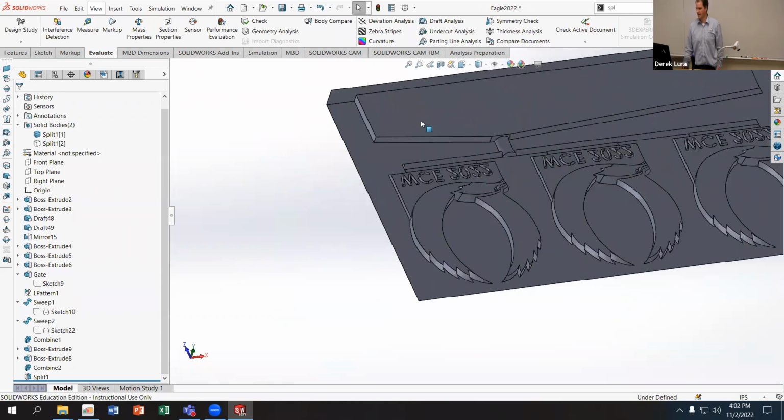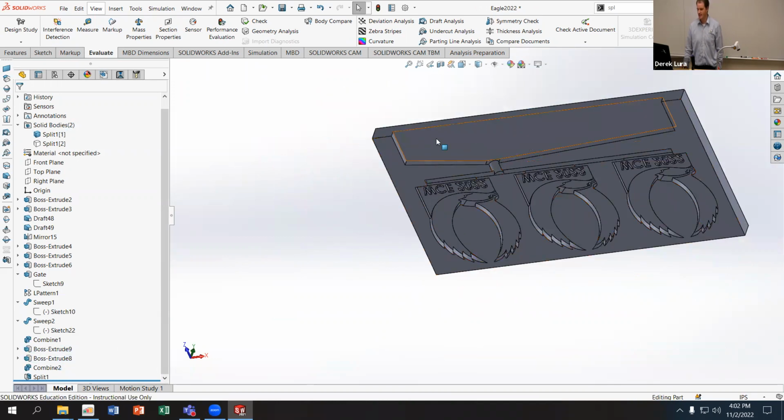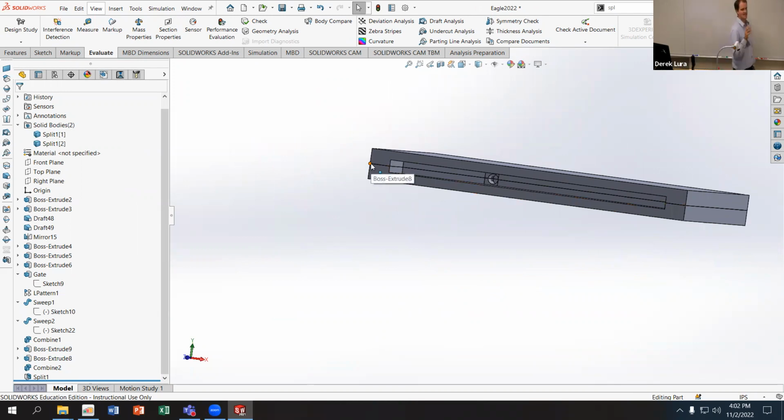Now what I have here in this void, which maybe I want to actually call the cup, is a reservoir right here at the top of my mold that is the same volume as my final part. So if I'm pouring material into this cup and the cup fills up, what does that mean? I've poured enough material. I know that if I fill that cup up, I've poured enough material into that mold. So even if it's fairly viscous, like the viscosity of honey, I don't have to worry about not having used enough material in that design. Does that make sense to everybody?